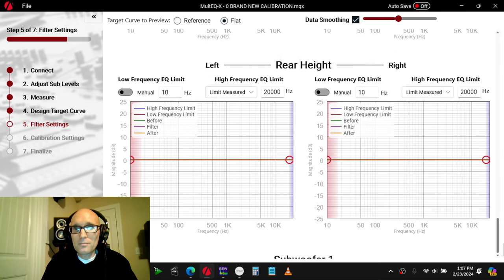Now you need to judge what is the best. You can see it in the response here, but the best thing to do is to start looking at numbers. What is actually the best performance? Blue looks to me as though it's the highest at 26 hertz. So blue is 90.9 dB, 60 hertz was 90.6, and 50 was 90.7. So we've gained 0.3 dB by just putting the align cursor in different positions, right?